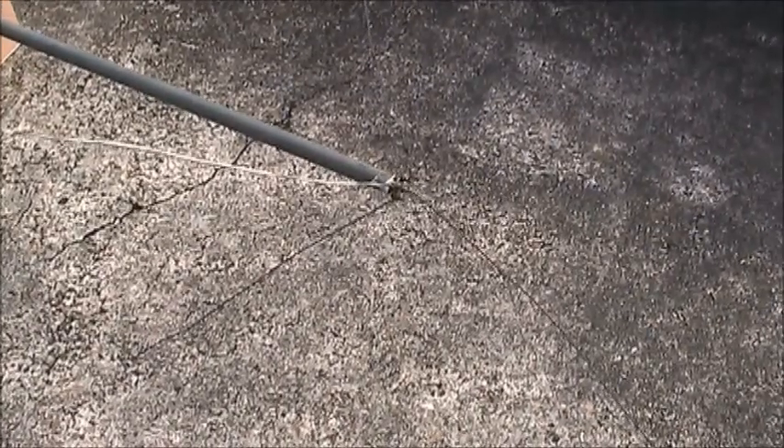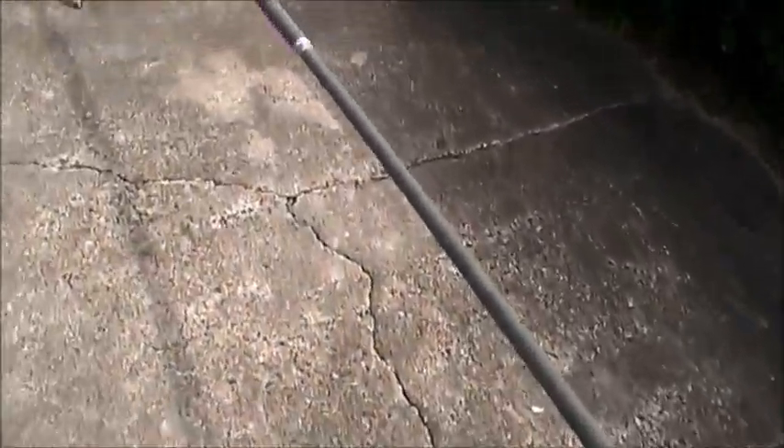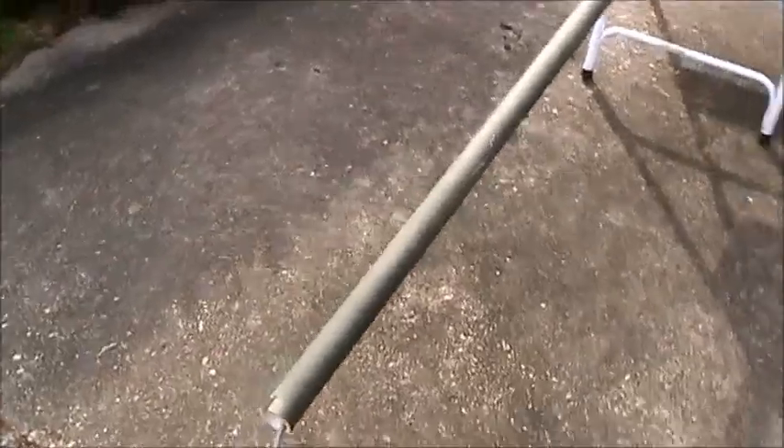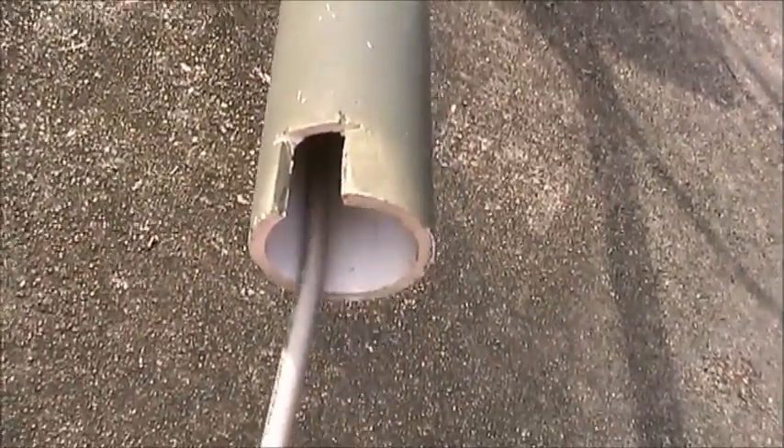Short video here relocating my two meter antenna. It's a two meter ground plane for 146 megahertz area, but I've got it on a PVC pipe and this is kind of my own homebrew design. Trying to get a little more height since I'm relocating. It's not very heavy. The pipe is flimsy and I cut a notch in the bottom right here — that helps the coax come out through there when you stand it up.